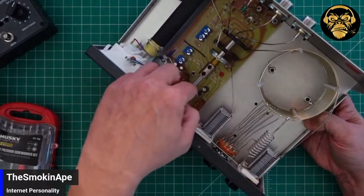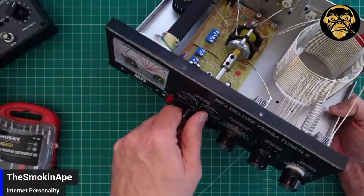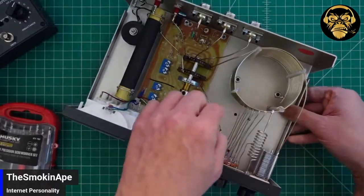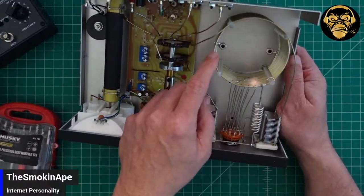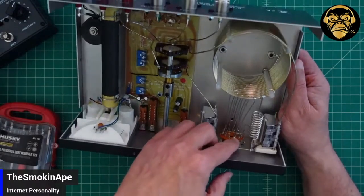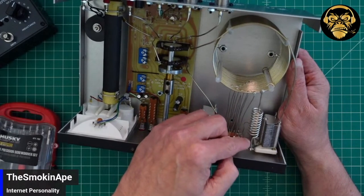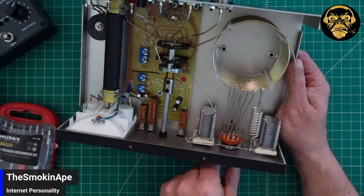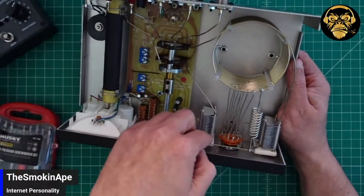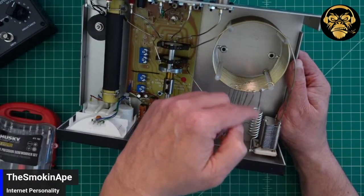This one's got a really long shaft on it, and that is for your antenna selector if you wanted to turn that. But this rotary knob here is for adjusting the taps on your fixed inductor. What's interesting is this one has this big coil on it, but it's got this little small coil over here. For the least amount of inductance, this is the setting right here on the knob, and it goes right into the center of this little one — so you'd only get this little itty-bitty bit of inductance. The more I turn this knob this direction, the more and more inductance it adds. It goes down the coil — so these would be the top of the T, and this connection coming in is our path to ground, the bottom part of the T.